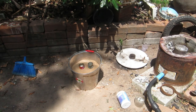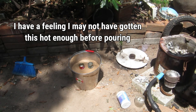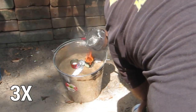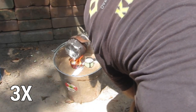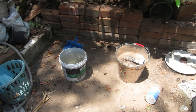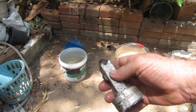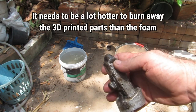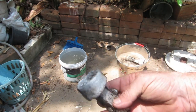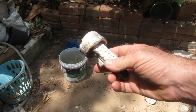I've ended up with not quite a full crucible. I'll pour the belt sander drum first because the other one's only experimental so it won't matter if it runs out. Well, spilling half of it wouldn't help, but we'll see how we go. As I noted before, I suspected the metal wasn't hot enough and this one proves the point. It only got partway — that's the lightweight foam bit and the square plastic piece which is still down in the sand. The way it didn't seem to want to run when I was pouring it made me think it wasn't hot enough.